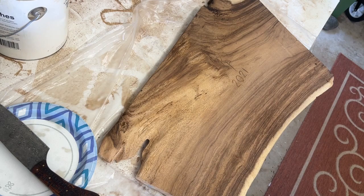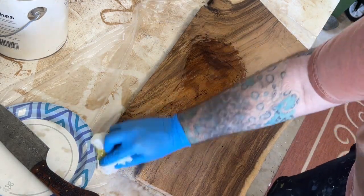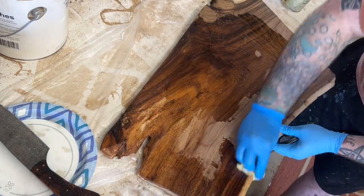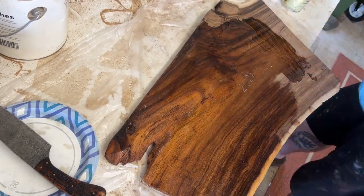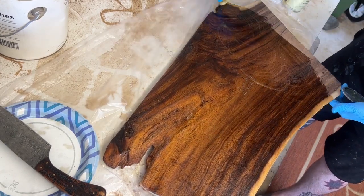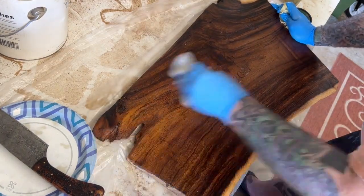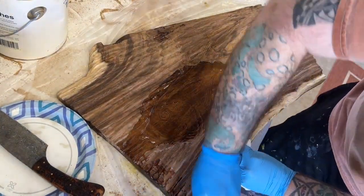Life gets in the way sometimes. So I'm going to put some oil and beeswax — it's a paste — and it brings out the wood grain really nicely. I'm going to put this all over it and let it sit for 24 hours, then decide if it needs another coat or if I should just buff off the excess. This pretty much marks a piece as finished in my book, because there's not really any altering to be done to it after you've got it oiled. You really have to sand it down and get all the oil off if you want to work on it more. So I'm quite serious about a piece when I start oiling it.